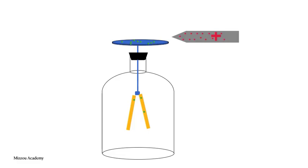This then gives us a way to determine the charge on an unknown object. If we know the charge on an electroscope is negative, and the leaves move farther apart when a body is brought close, then we know that body was negative. But if the leaves move closer together, then that body must have had a positive charge. So that's it for our discussion of electroscopes for today.